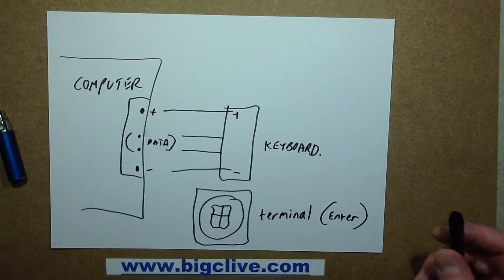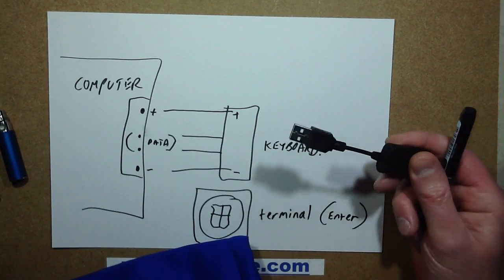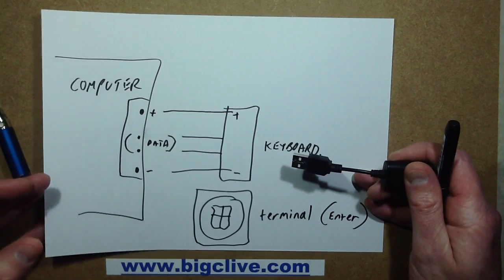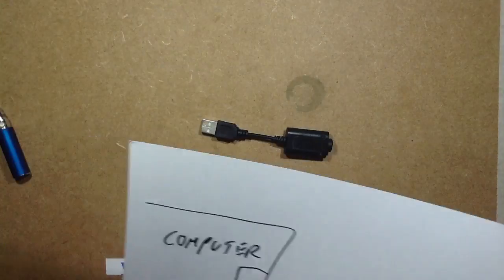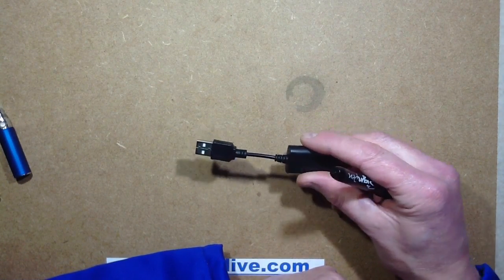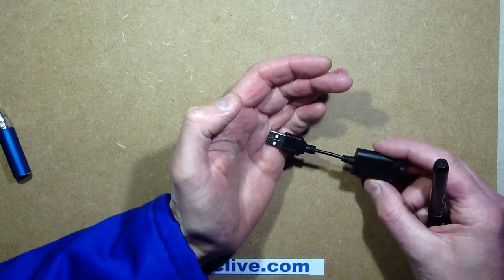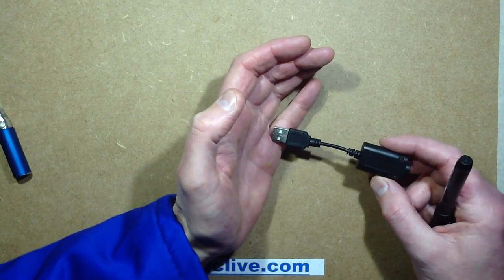But here's the thing: if you plug a charger into your computer and it's got any active electronic circuitry that registers as a peripheral, your computer is going to make that bing-bong noise. If you plug it in and get that noise of something logging on, you know there is active electronic circuitry there. If you plug in something that's just taking power but not communicating on the data pins, it won't do anything.